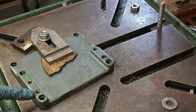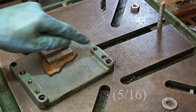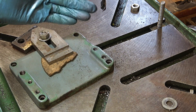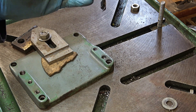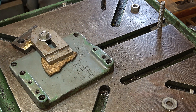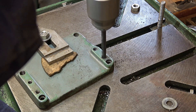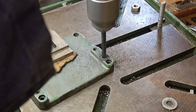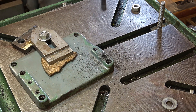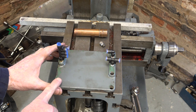This is the back inspection cover from the shaper. At the moment there are four oiler points tapped one quarter. I'm going to put 1/8 BSP unions in here as well. I'm drilling at 8.5 — that's a bit small really for tapping 1/8 BSP; it should be 8.75 or 11/32. I haven't got an 11/32; I've got an S but that's about 8.9 which is a bit too big. So we'll just manage with 8.5 mil. I've set a depth stop — drilling to about 8 millimeters.